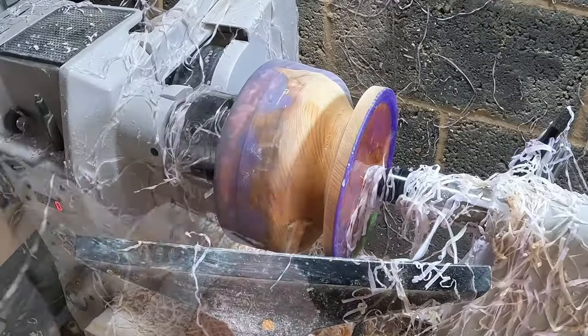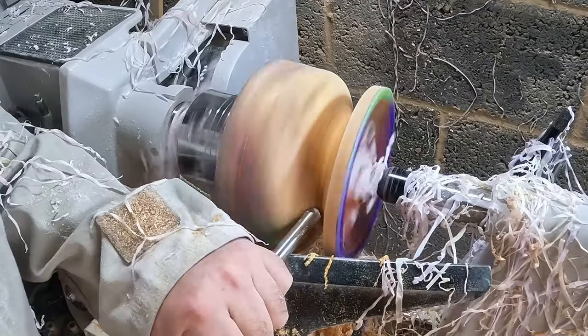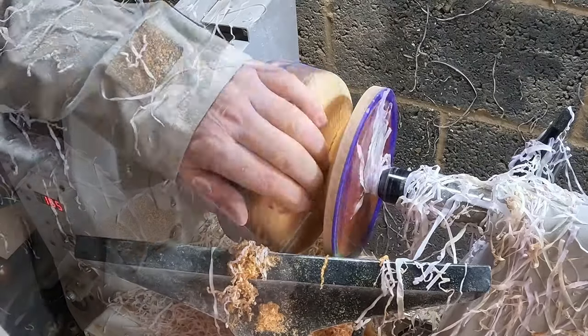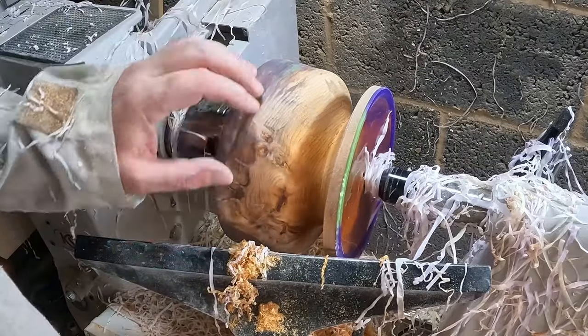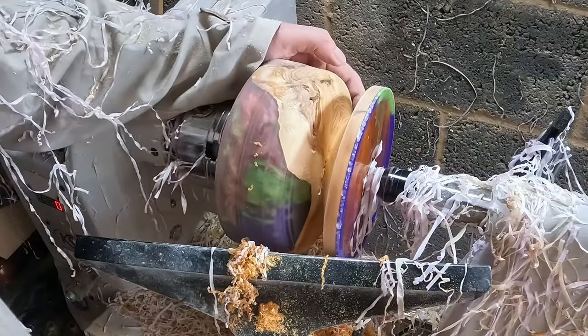As I suspected, when I finished getting the upper section roughly to shape, the base and cutout needed some more work, so I set to with a gouge, making it deeper and reducing the diameter of the base. And wouldn't you know it, I had another catch, which forced me to remove a bit more material, but that worked out okay in the end.